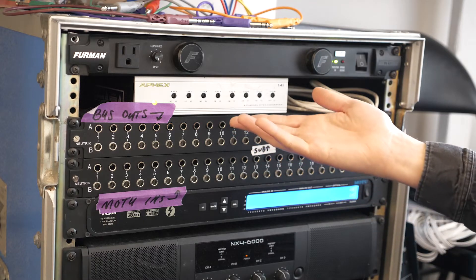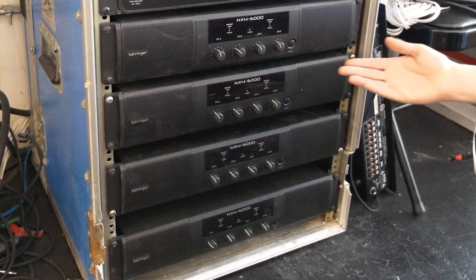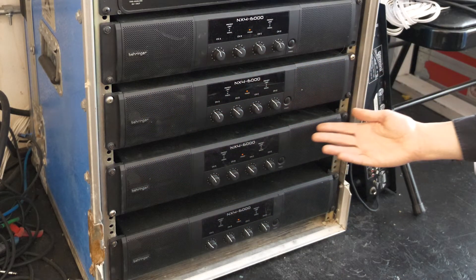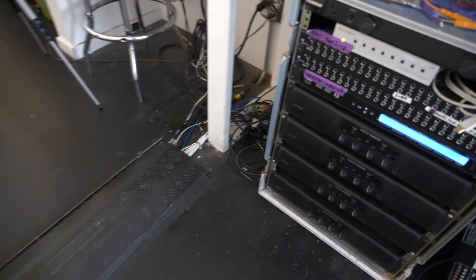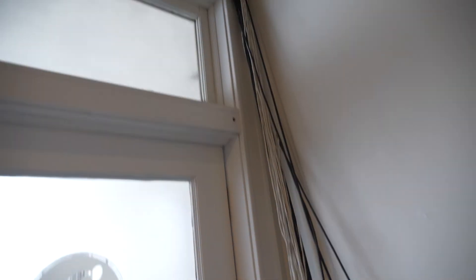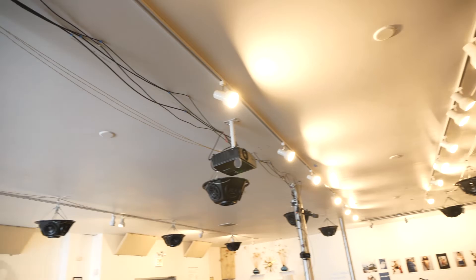If you need some additional outputs to direct audio to the house sound system and sub, those are available via the Apex digital-to-analog conversion device, which is connected to the Motu 16A with an ADAT cable. Each of those outputs is connected to one of the 16 amplifier inputs. The amplifiers are set for the room and speakers, so please don't touch the dials. Instead, you can control your playback level from the computer. From the amplifier outputs, powerful amp-level signals travel via speaker wire through the Elastic office and on to the Hemisphere speaker inputs, where they are connected via quarter-inch plugs.